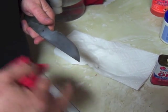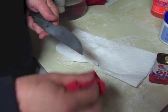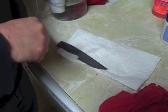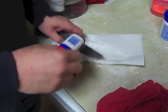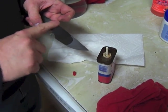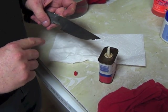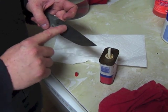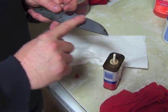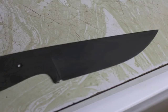Then I put a coat of oil on it. What that does is displace any water that's down in the oxide finish. I'm just using three-in-one oil here, which works to displace water. I put a real generous coating of oil, and I can see little bubbles of water coming to the surface of the oil. This draws out all of the water and also smooths out the oxide finish and makes it look good.